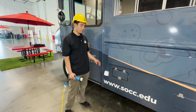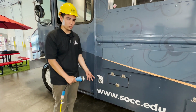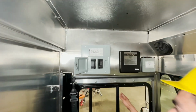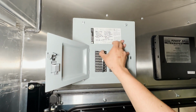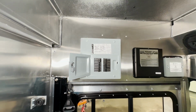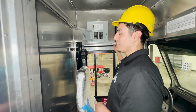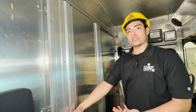All right, so apart from the generator, you also have a 50 amp plug. Whenever you don't want to use the generator, you can just plug up to any utility. Okay, so once your generator is on or you have your utility power on, you can go inside the breaker box and power everything up one at a time. You want to go slowly, and also make sure everything is off when you power it up. So right now that we barely turned it on, you can now power it up one at a time. All right, now you can follow me. We're going to go inside the truck and see how everything works in there.